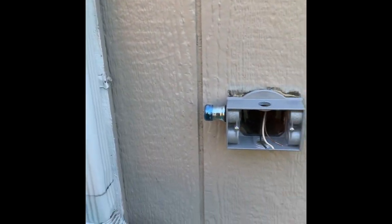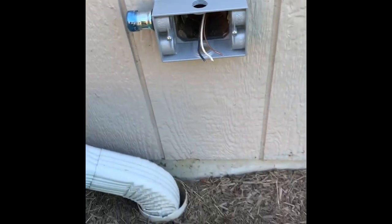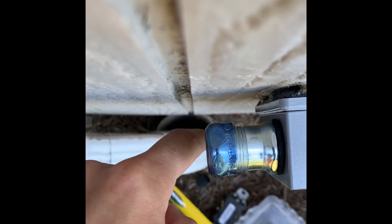And from here, we're gonna go about 8 feet up, just above that line, and do a little 45 degree angle up to the round electrical box. And we'll mount the box there. We'll clamp the conduit to the wall and get it ready with a box offset. You can see that's probably about 3/4 of an inch off the wall. So the conduit is gonna come in flush and we'll have to offset it just a little bit, and I'll show you how to do that.